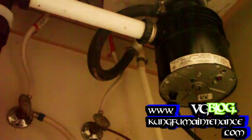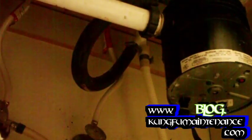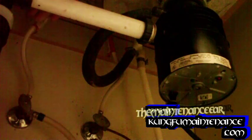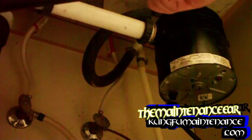Anyway, we've got to unplug our plug here. Undo our disposal drain line. Carefully, there's usually some water left in the line there. We're going to replace this piece with what's called a tailpiece. It looks like this instead. It's got this flanged end that we can stick our rubber gasket up against and link that to our disposal. I usually use my knee to lift this up and then turn these locking plate out.